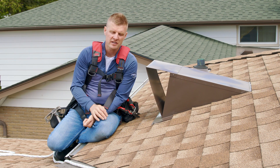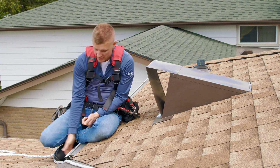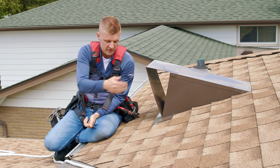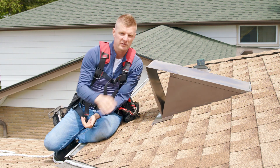I can't say enough about these vents. They've helped me out on tons of different roofs everywhere we go where we can't get air in through the soffits. Sometimes it's poor construction, sometimes the insulation's blocking it, and this is a perfect example of how this helps the system work.